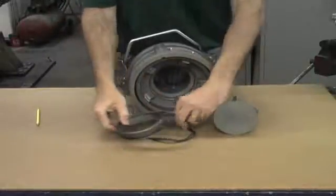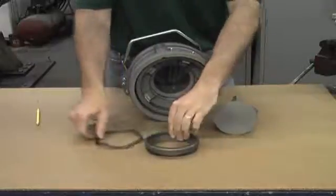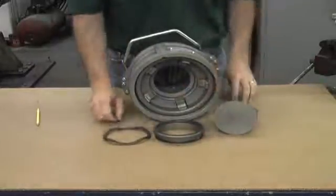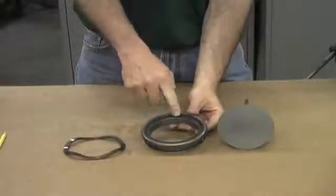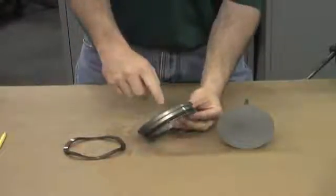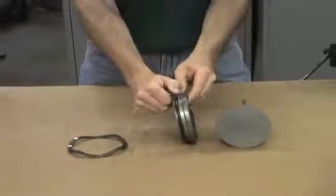Remove the cylinder and the wave spring. Once the cylinder and poppet are removed, we can change the seals. From the seal kit you will receive a new nose seal as well as the cylinder seal. Remove the cylinder o-ring first.